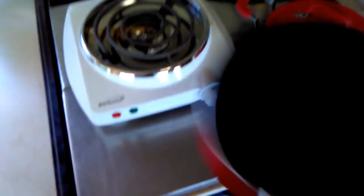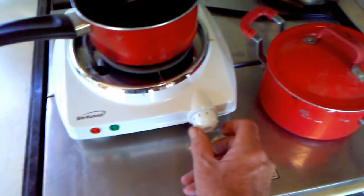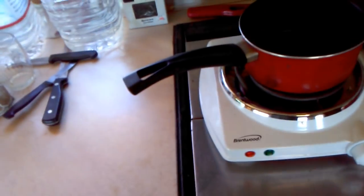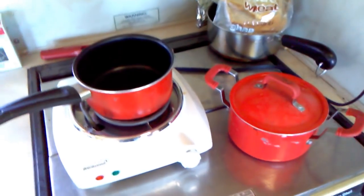For cooking I've got a little electric induction thing. Even on low it barely turns on before jumping to 850 watts — it clicks on and off, it doesn't work like a space heater stepping through 250, 500, 750 watts. Back here I have several vampire loads, like a timer for the refrigerator. I have it set for close to 12 hours a day. Seems to work very well — just before it clicks off at the end of the day, the sodas in there are just getting slushy frozen, which is the way I like them. Then it shuts off until 6:30 the next morning.